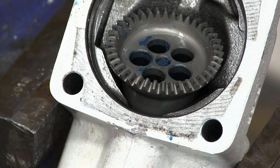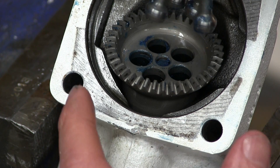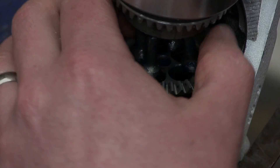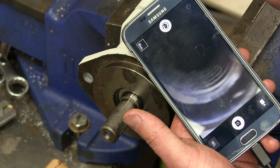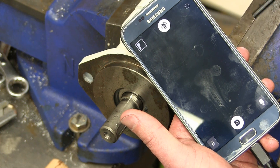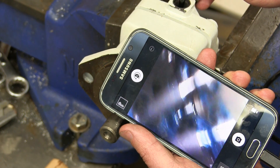So the problem is the mating piece does not have timing marks. What I should have done when I took it apart was put a little witness mark on there. Now we get in there with a flashlight and just got rid of this ring — and lo and behold, there is a mark here. Initially it just looked like a grinding mark, but it appears as though it's the only one there — it's got to be the timing mark. So now we get this in here — trust me, it's easier than it looks. We're just going to go in there with the borescope. Android borescope — 15 bucks — these are great. And she looks like she's good to go. Get the timing mark and all that proper.